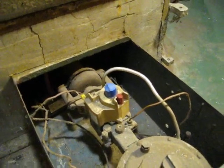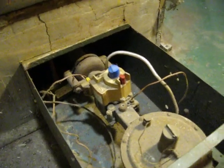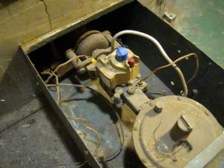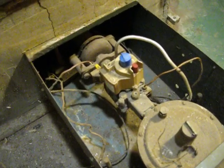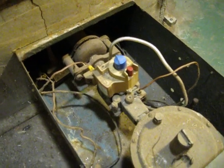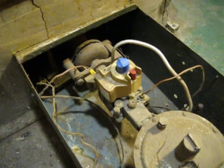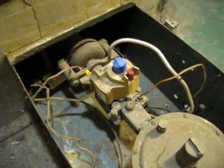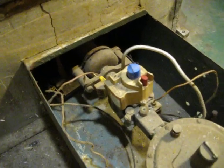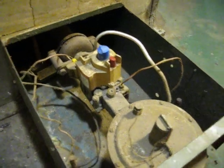I have my heat upstairs cranked up all the way. When I need to restart it for the season, or after it mysteriously shuts off — which I'm sure it will do at some point in the middle of the winter — you hold down that little red button. That gives you gas. It overrides the thermocouple for a couple seconds, giving gas to your pilot light until the pilot light heats the thermocouple up enough to convince the furnace that the pilot is lit.